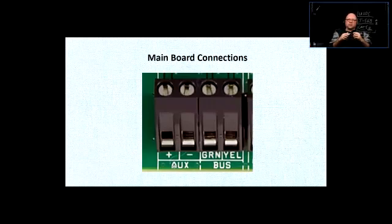What other device would be? An expansion board. Like if you have a security system that is capable of so many contact points, which are called zones, that those contact points can be used to monitor a certain loop, which we'll talk about in a second. And if you need more zones, then you can get an expansion board, and that also has to be powered. So this is supplying the power to all the active devices.